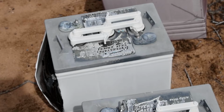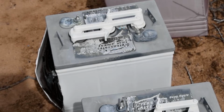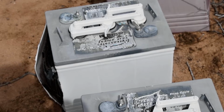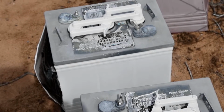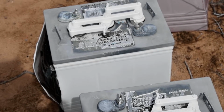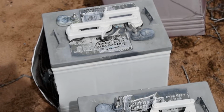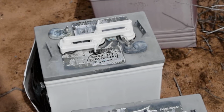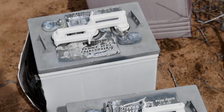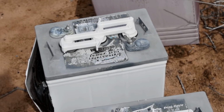When people use water that's not distilled water, then there's minerals in it. And what happens is the minerals, they get between the plates, and sometimes they fall at the bottom of the case and short the plates out, so you should never use just regular drinking water. You should use distilled water. But anyhow, you can take a welder and put it on low amps.